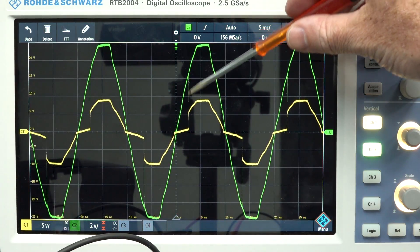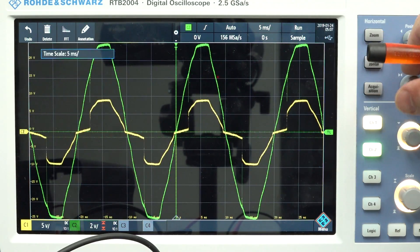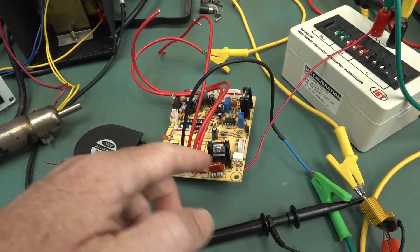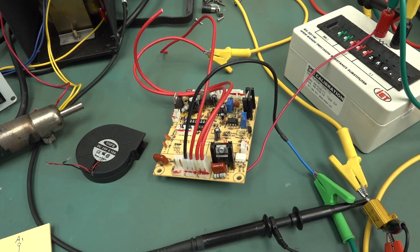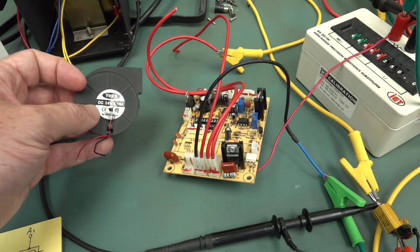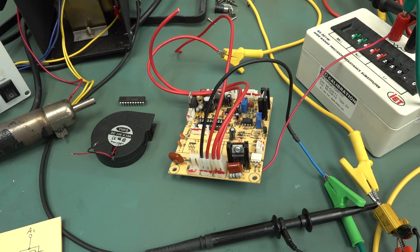You can actually see a little current pulse in there when it switches. So we can control the turn-on and turn-off time of this TRIAC and it seems to work. There doesn't seem to be anything wrong with it. Yes, it could fail at high voltage — there could be some high-voltage-related issue we don't know about — but it definitely hasn't failed short and it does actually work as a TRIAC. So in this particular case, that's not the failure mode. My money's still on the fan failing, and then something to do with the algorithm or measurement inside this thing couldn't cope.